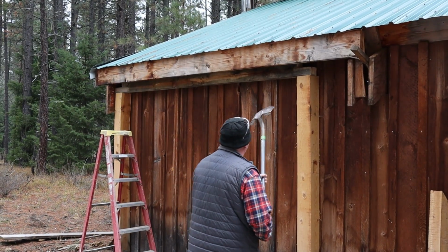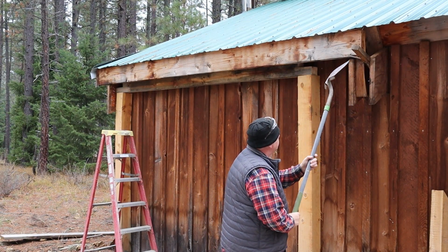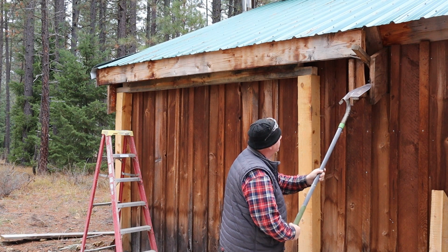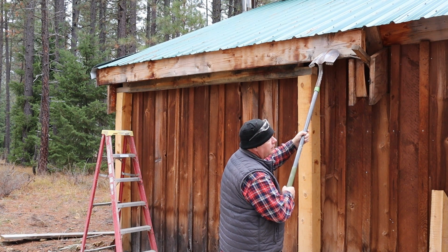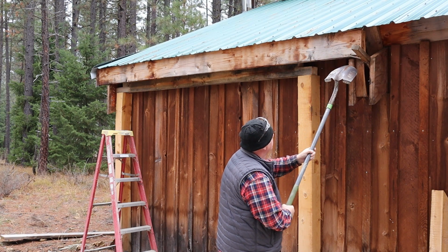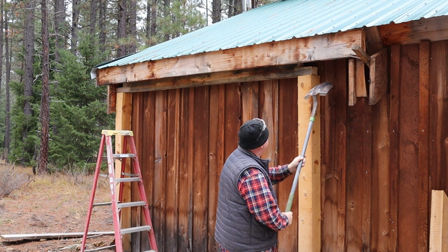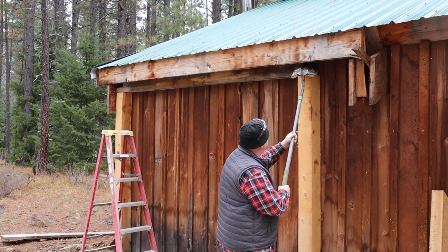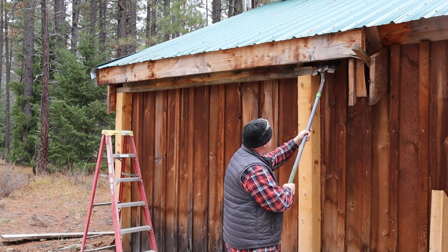This is the piece we manufactured. This is the piece that I haven't manufactured yet, but I own. See this LVL? This LVL, double LVL, pre-existing building. The eave board used to have a fascia on it, but I took the fascia off already. I've got to cut these LVLs back against this building to get enough clearance for this piece of 4x6 to go across. So I'm going to establish that one.